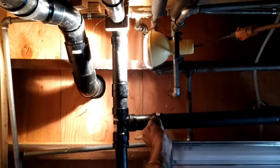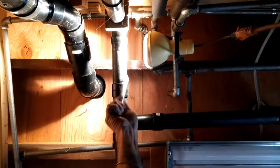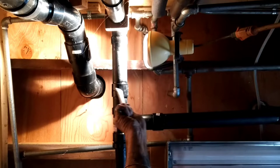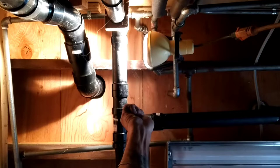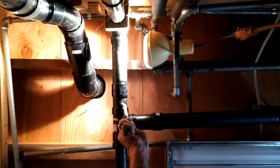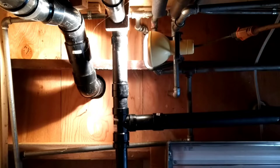This T right here is the drain for the shower. This one right here is the main drain, right down out to the sewer, and that's where the vent is — it goes up that way. You can see it's broken right here; this collar has been broken before. This broke clean because it froze this past winter — there was some water left in the drain. We're at 7,000 feet here at the mountain, and up here it gets three feet of snow. If you leave water in your drains and you're not attending to your house, this is what's going to happen.